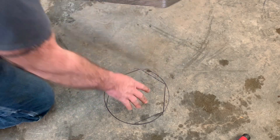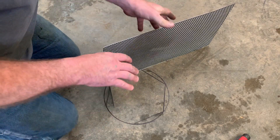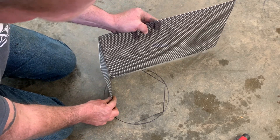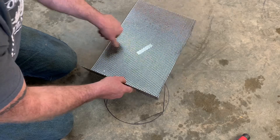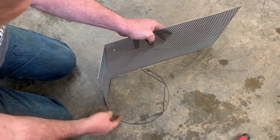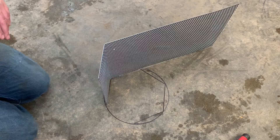Here's where that form on the floor comes in handy. I bent this just a little bit more than needed. Now I want to take the straight long edge and follow one of these lines right here. I'll put this bend right on the corner. This wing is bent a little bit too far, but that's just fine — I'll lay it on the floor and push down on it just a little bit. Now we have our first bend and our second bend, right to the line. There's a nice straight bend right to the lines we marked on the floor.